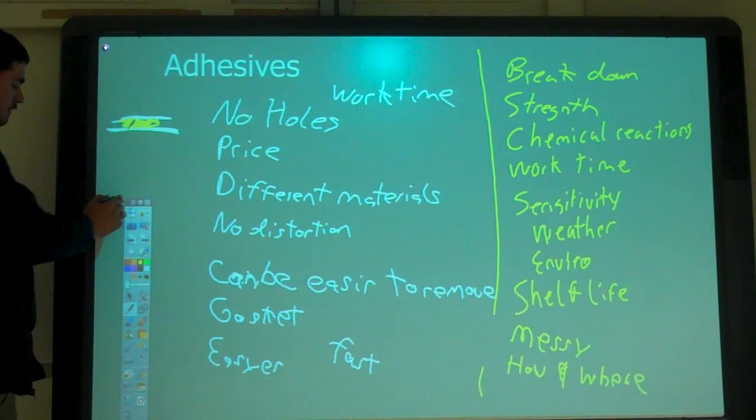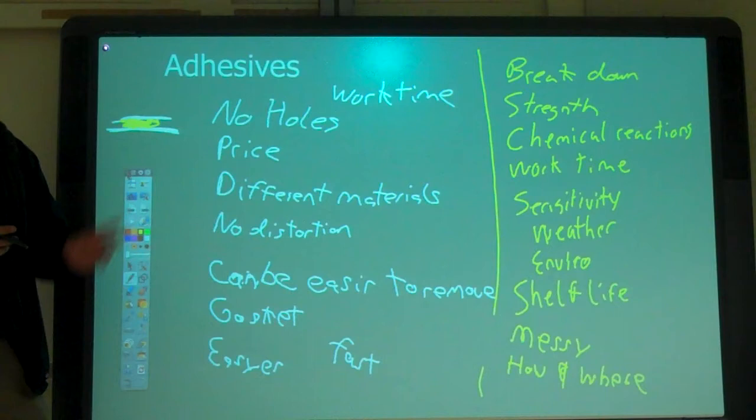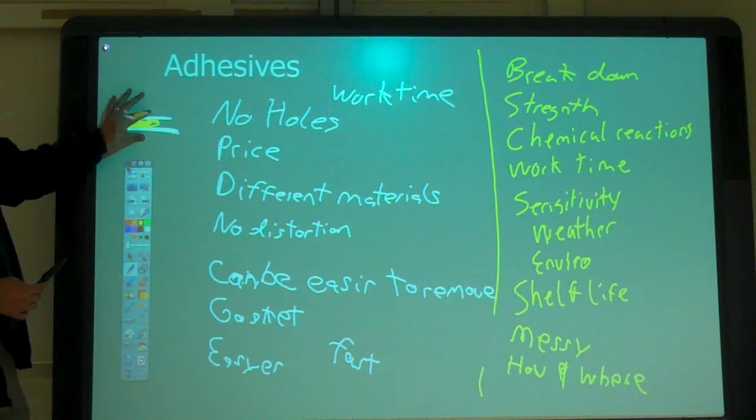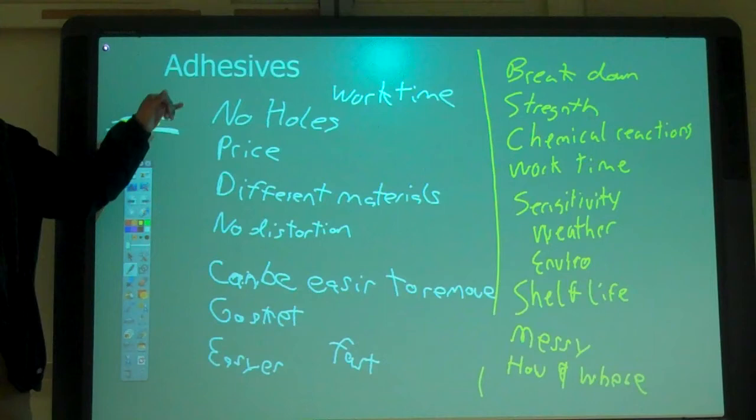It took working with the vendor, figuring out which adhesive to use, how much to use, how fast to apply it, all of that to figure out the right mix. By the time you lay it down, the time you've got to clamp it. And then how tight we wanted to clamp it, because those two didn't need to touch. We wanted to have some of the adhesive left between them to make the bond. If you clamp it too tight, then there's no adhesive left in there.